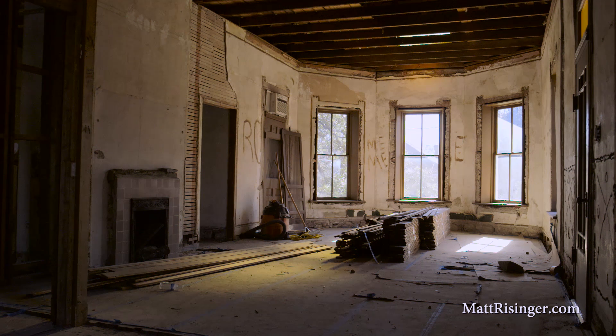The last topic: what would we do differently if someone watching this in Michigan has a similar building? The biggest difference — the most important takeaway — is where you would put the vapor control layer. You would move it to the inside in heating-dominated climates like Minneapolis. Here in Texas, we would prefer it on the outside. So for a full masonry house in a heating climate, can you give a couple of assembly ideas?